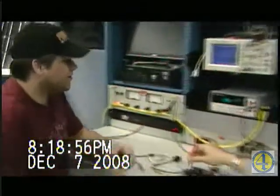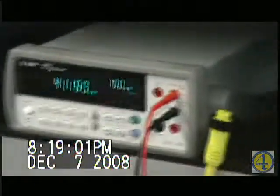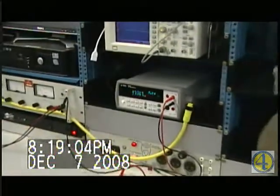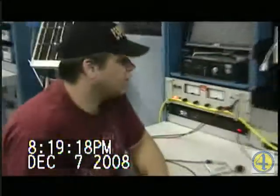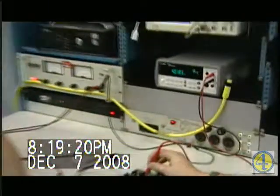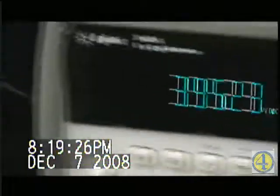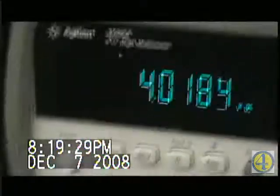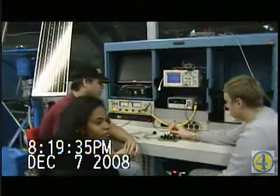We are going to measure the output from the differential amplifier on the Max 4173 — this is the voltage to the PIC for current sensing. The reading is 0.6, in the range from 0 to 5. And the voltage divider is giving us our voltage reading, which is approximately 4 — also in the range from 0 to 5. At a max of 17 volts input it's going to stay under 5. That's pretty much it for the current sensing and voltage sensing portion of our circuit.